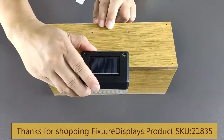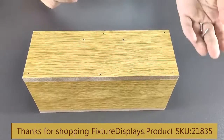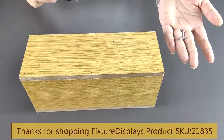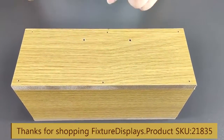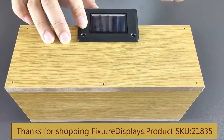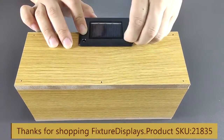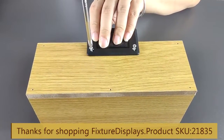If you were to mount this on a flat wall surface, you're going to make some modifications — build a small block to go on the back side so there's a ledge on the unit, then you can do a flat wall mount. You can also use screws to directly fasten to the edge or a ledge of some sort; you'll want to drill two pilot holes and then fasten the two wood screws.